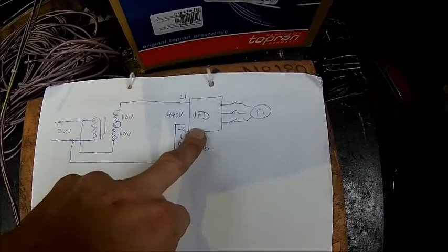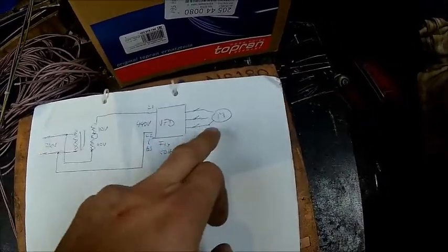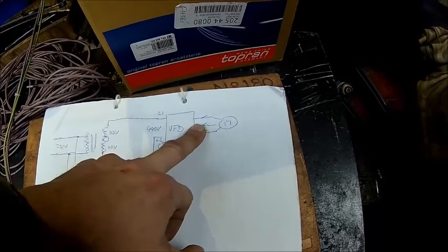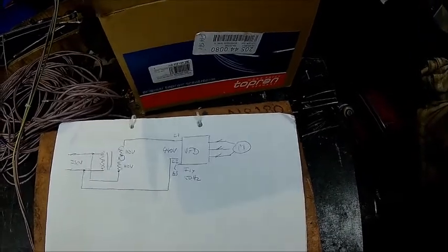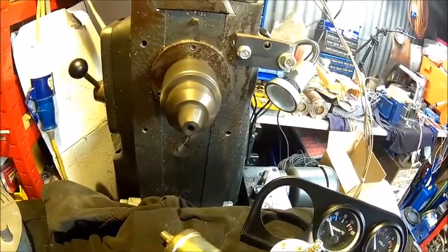This thing is set to 50 hertz — we've got a switch here, I'll show that in a minute. So if the switch is open, this thing is constantly running making 50 hertz 400 volt AC on the output. If we switch the motor on it may go into current limit but it will run quite nicely. We switch the mill on, it runs up through the current limit and everything is fine.